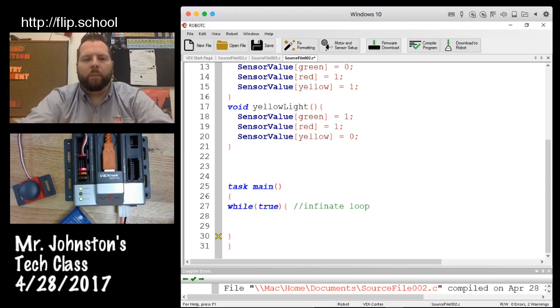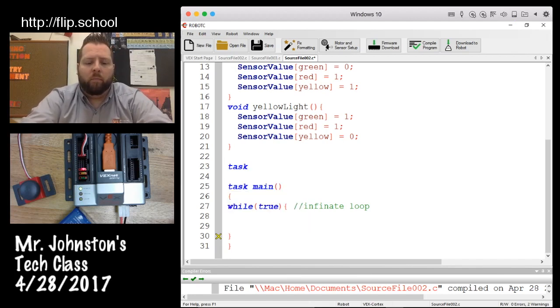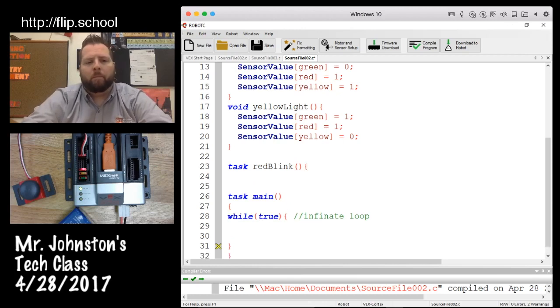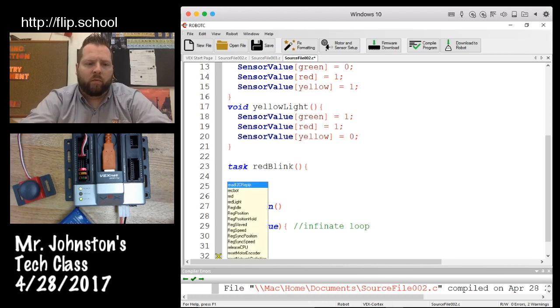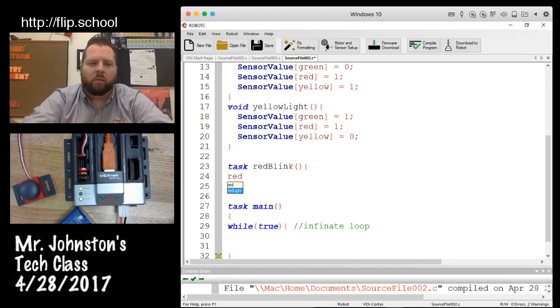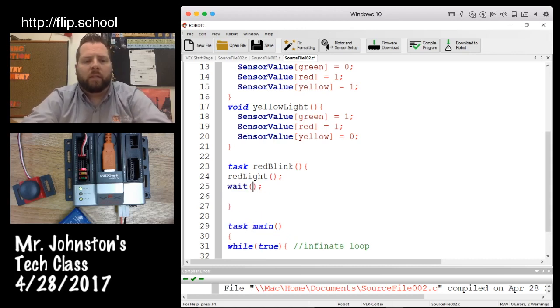So I'll set up a task that is going to be called red blink. We'll call it red blink. All right. And I'm going to do red light, and that's going to go on. I'm going to have it wait for, say, a second. Actually, that's too long. Let's do half a second.